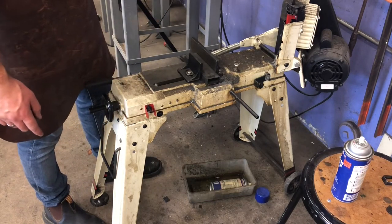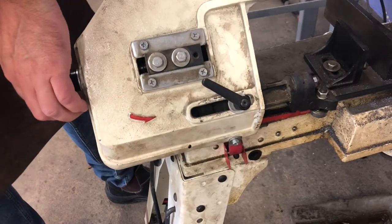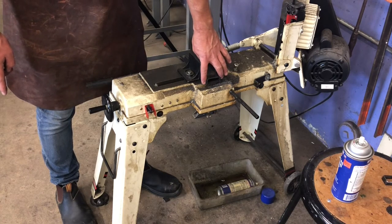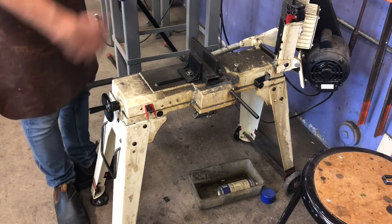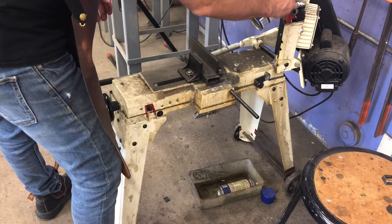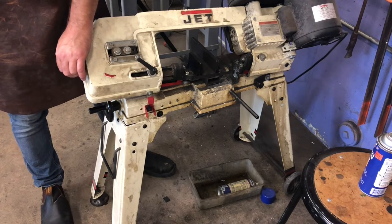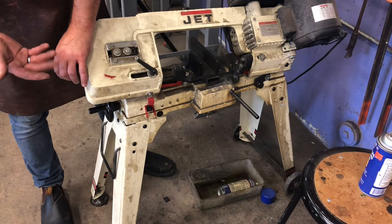When I make this cut, once the saw cuts all the way through, this little red tab will turn the saw off for you automatically. The saw is going to go very slow at first because it has to cut through the full width at the top. Once it gets through that top layer it'll cut faster; as it cuts down the two sides it'll slow down again when it hits the bottom. Before I start, I'm going to take a little cutting fluid and spray it on the blade while the saw is moving so I know it coats the entire blade. I'm going to let this work nice and slow — not pushing down, just gently guiding it and letting the saw do the work.